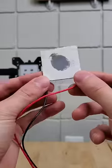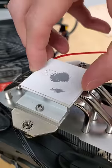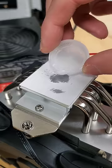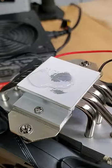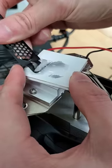What? This, my friends, is known as a Peltier device, which takes advantage of the movement of electrons to transfer heat from one side of its semiconductor material to the other, causing one side of the device to get so cold that within a mere 60 seconds, water will just freeze completely right on top of it.